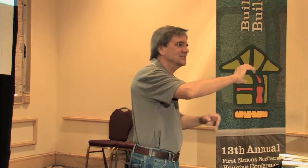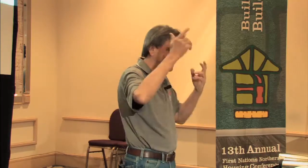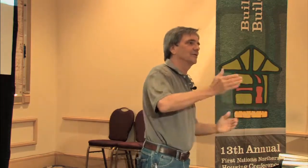Well, the thing is, you turn that off as soon as you leave and it hasn't finished. So ideally, you have a dehumidistat. Okay, it's going to cost you 20, 30 bucks. But you get a dehumidistat that has an on-off switch, but also has a humidity setting. And if it's really humid, the thing goes on by itself, and it stays on until it dries out and drops down. And the hard thing, of course, is to get people to use it because they say, oh, we're wasting electricity. And you just got to drive home.